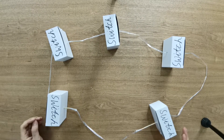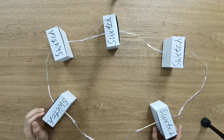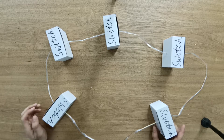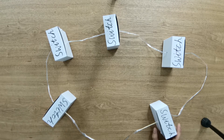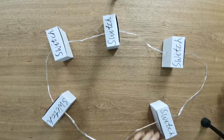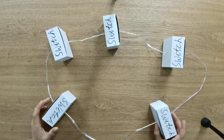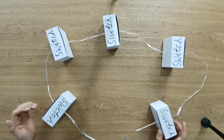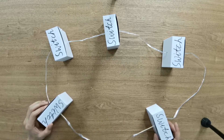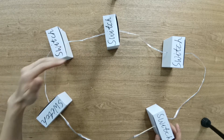This is the typical ring. Each of the ports stands for a PoE switch, so we can connect cameras to the switch to get both power and network. We can pick one of the closest switch links to connect to the primary network, so we can have the NVR connect to receive video from each of these switches. Now in this circle, if one of the switches or links breaks, we can still find the opposite way to return to the control center.